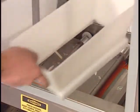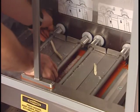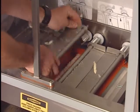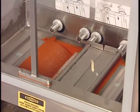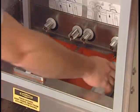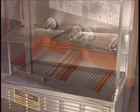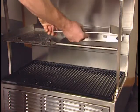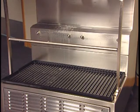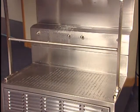Lift out the accumulator housings. Take out the accumulator doors by rotating the coupler nut counter-clockwise until it unseats from the accumulator shaft threads, then pull the door forward to remove it. Repeat this process for each accumulator door. Next, lift and remove the left and right flap door assemblies. Remove the basket guide assemblies by lifting the front of each guide until they unlatch. Finally, lift out the drip tray at the bottom of the basket storage area and take it, along with all removable components, to the washing area.